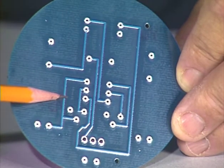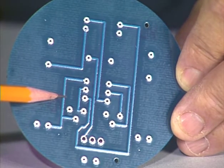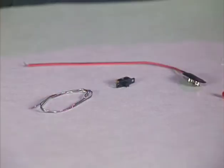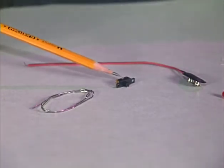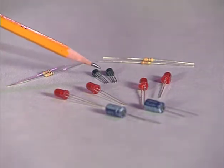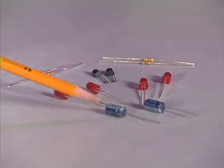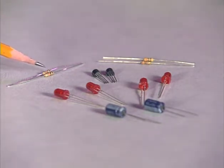These are strips of copper metal that serve as electrical connections between soldering pads. These copper strips are known as traces. The traces and the components, after they are soldered in place, make up an electronic circuit which performs a function such as blinking lights off and on. There should be a length of 60-40 solder included, a slide switch, and a 9-volt battery clip. You need to supply a 9-volt battery that makes your Blinky work after you finish the project. Also included are the following electronic components: two transistors, four red LEDs, two 100 microfarad capacitors, two 330 ohm resistors, and two 10K or 10,000 ohm resistors.